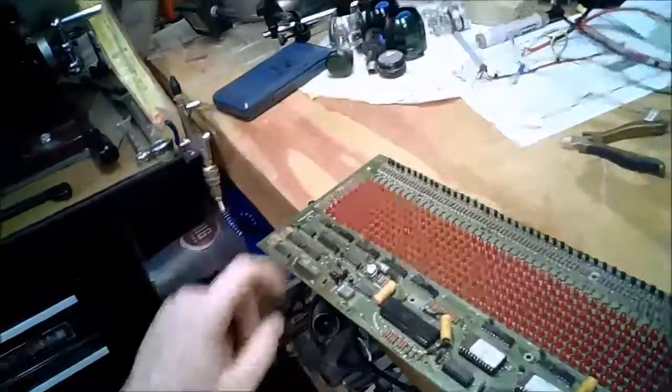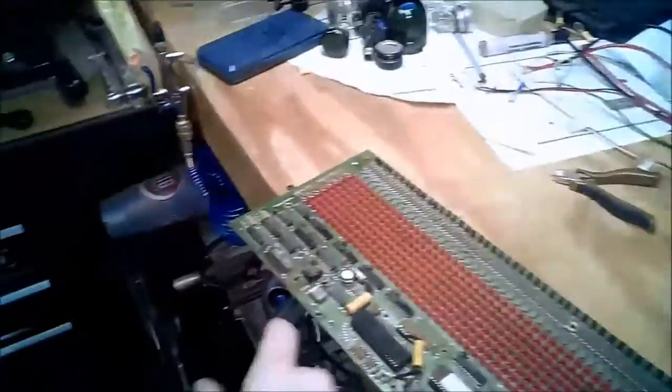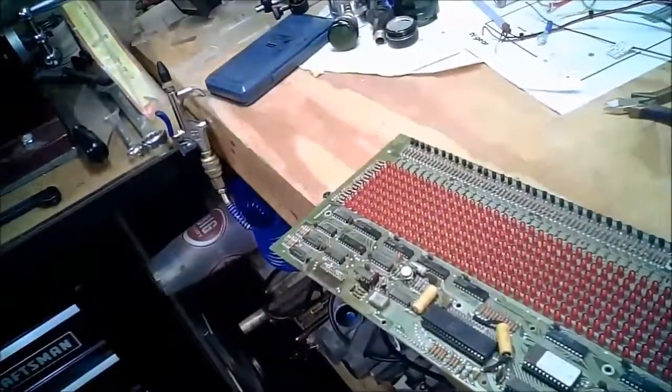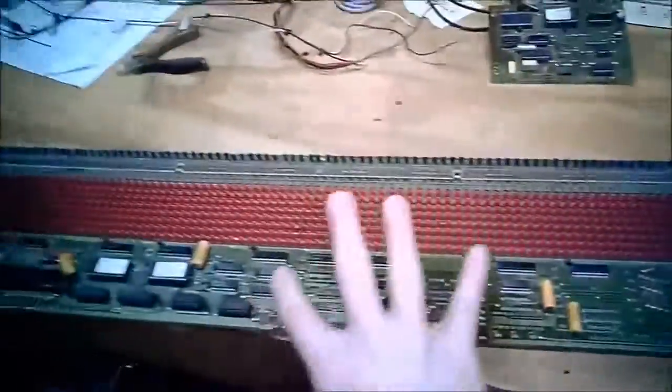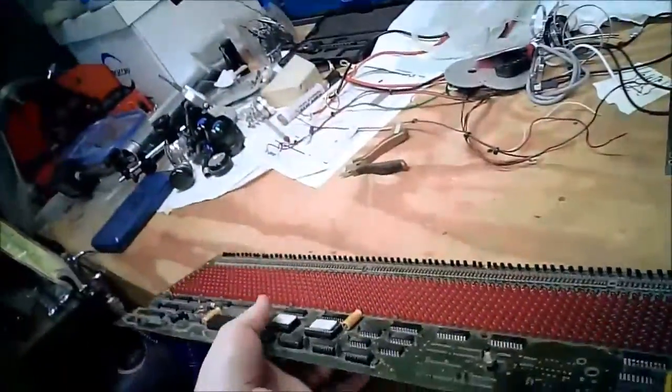Next thing up on my list to finish is I want to go through what's left on this keypad input, because I'm betting a few of the chips over here can go away. And then to start digging into the driving logic between all these chips, the micro, the flash, and the RAM, or the ROM and the RAM, and the various timing and P-good circuit, reset circuit. But I may finish up taking off the unnecessary circuitry, so these two, this, and whatever's just for this keypad, and then leave the debug, or reverse engineering, of the rest of the stuff until another day, because it's getting kind of late here.